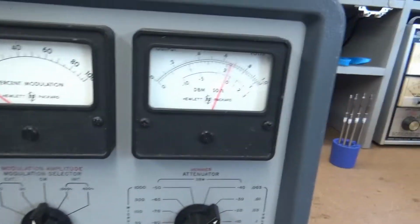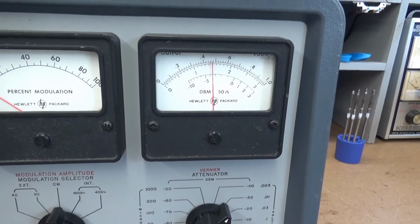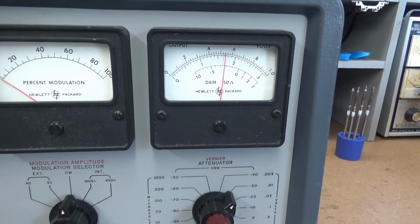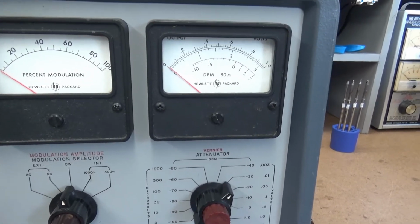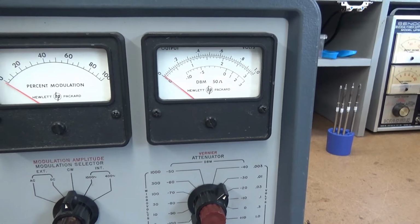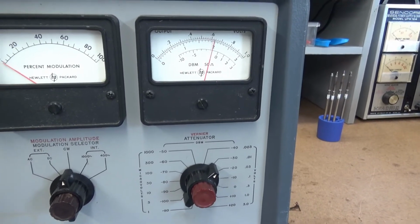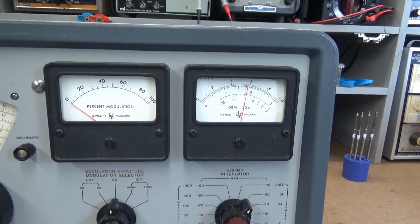Right now the third band is 530 to 1800, and it's doing it. Let's switch it down. See? It's doing it on the 165 to 560 kilocycles. It's also doing it on the 50 to 170. That is the same exact symptoms that I had before, and I'm wondering if it's the same thing. When I get into this, I'll show you what's going on. See, as I mess with this knob, I have a feeling I know what this is, and I apparently didn't repair it right.